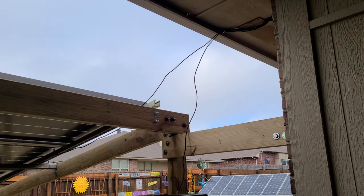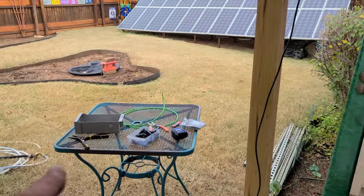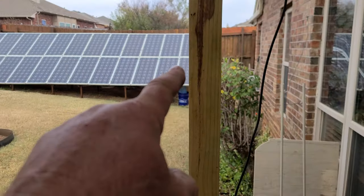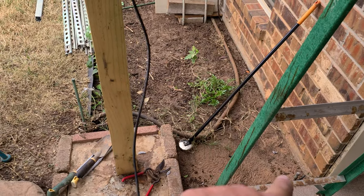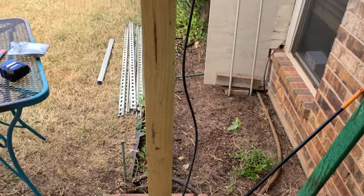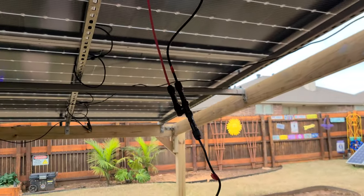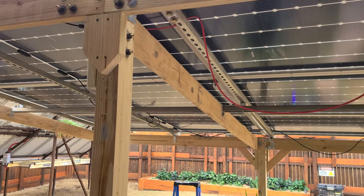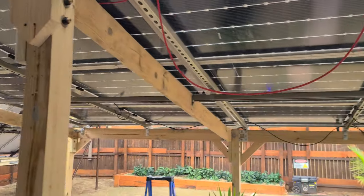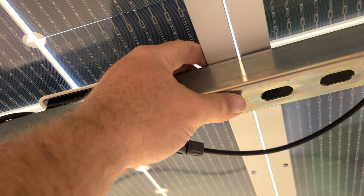There's a wire man up there. What I'm going to do is mount the combiner box right here, and I've got a grounding eight-footer going down right there, deep down. I'll just wire them right up, but I've got some temporary combiners or splitters in there right now. I'm going to bolt these down so there's no gap with those spring nuts.